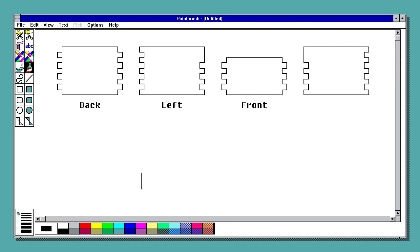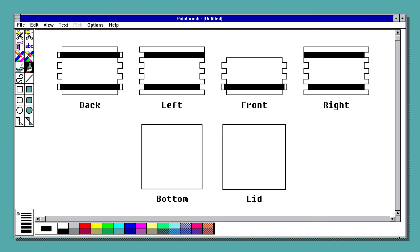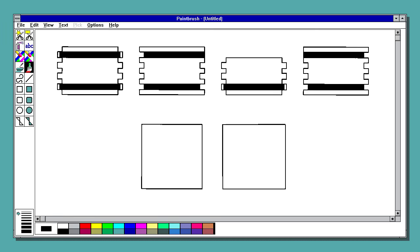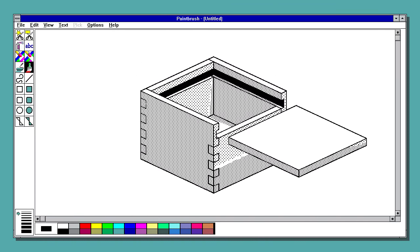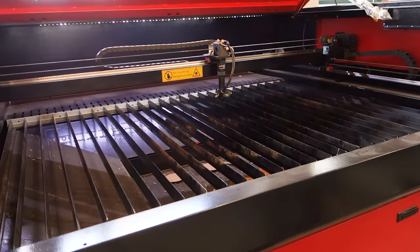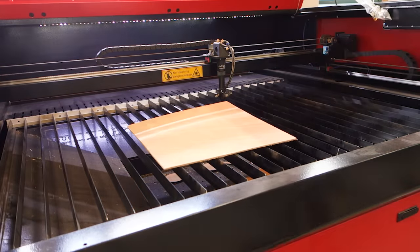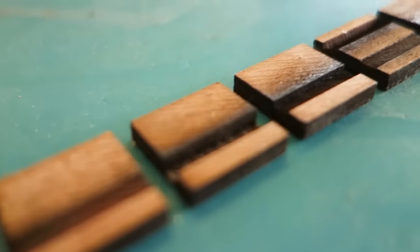What I've done here, which will be more apparent later in the video, is to add two black rectangles on each piece, which will be etched part way through the plywood to create two grooves into which the pieces to fit the bottom of the box as well as the sliding lid will go. This obviously requires a bit of extra setup time in the laser cutter, cutting out test pieces to make sure you get deep enough engraving for your grooves.